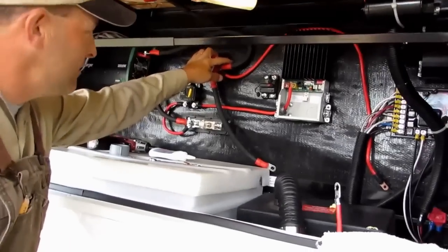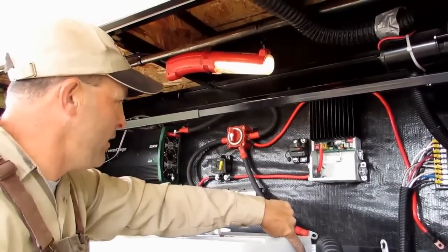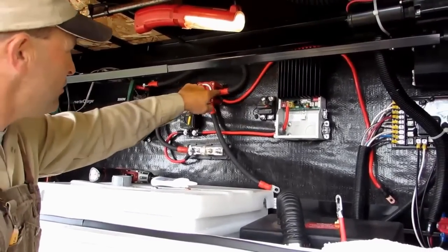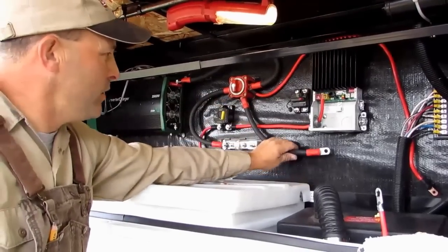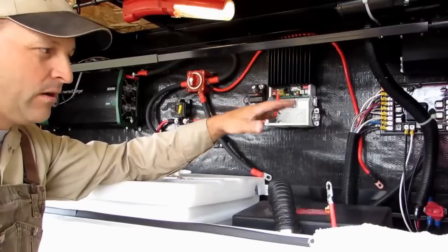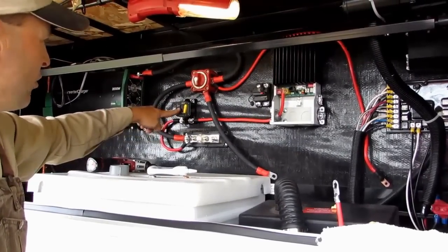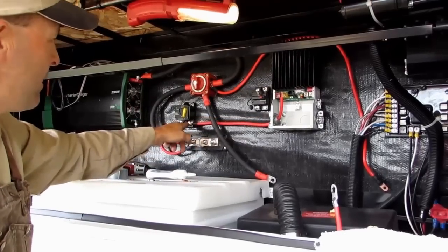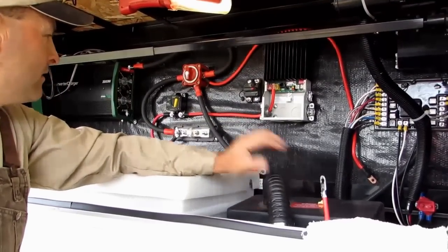What we've done since the last time we took a video: we've already hooked up the switch — that was the one main thing. We've got our feed for our battery, battery bank one into the fuse into our switch. We've got the inverter and the feed for the house panel. And we're waiting for another catastrophic fuse — that's going to be for his second bank. He's going to put two six-volt Trojan T105REs in here and pick those up when he goes down to Phoenix. This is our charge controller, the breaker for the charge controller for bank one.